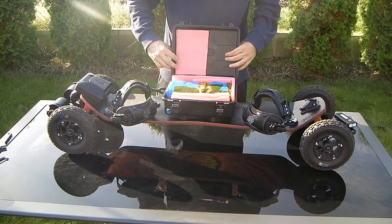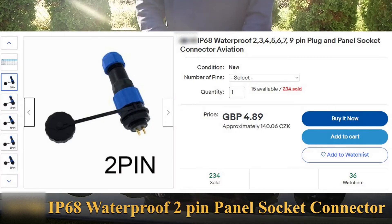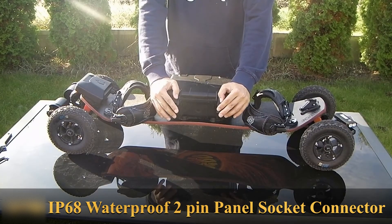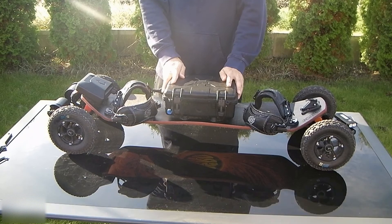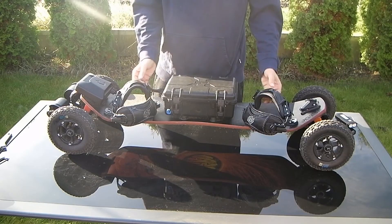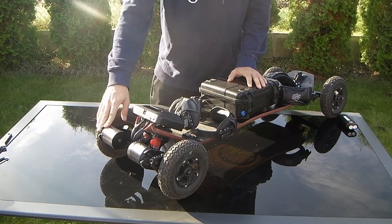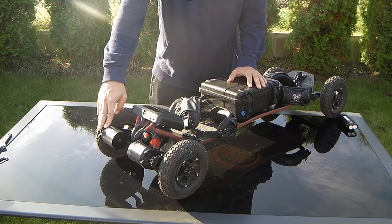Everything is compensated by the rubber. On the side you can see the pin for charging — I'm using a pin with IP67 protection, and for the battery I use neutral silicone to fix it. I covered the screws with foam because the silent blocks are fixed by screws from the top. Foam covers the silent blocks and in the middle there is a gap for silicone. This works well — I have flex without any damage to the battery box.